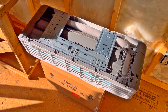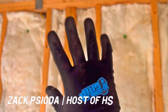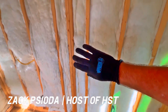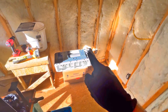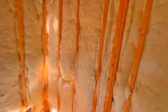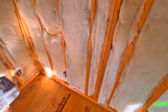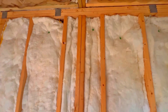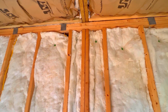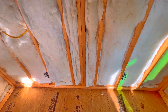I'm trying to get this mini split up today in my streaming area. I'm going to put a wall plate up here and get this wall sheathing done, at least in this area. The line set will probably go out through here depending on which side it comes out - looks like this side, so maybe the opposite side. The lines go down the back of the building to the heat pump outside. I have to get some stud guards in the wall where some wiring goes through, then I can get to work putting the sheathing up. Hopefully getting some conditioning in here, if not today then over the weekend.